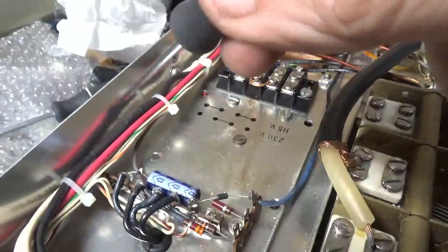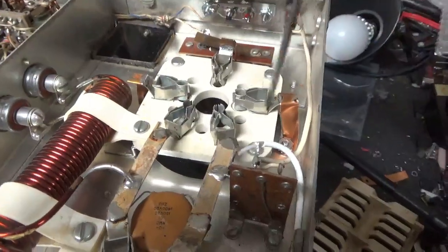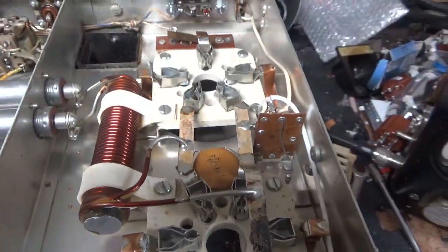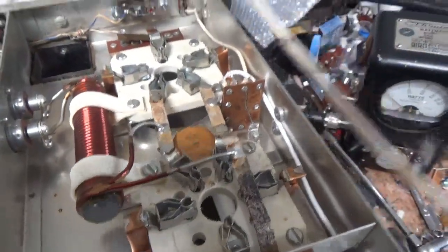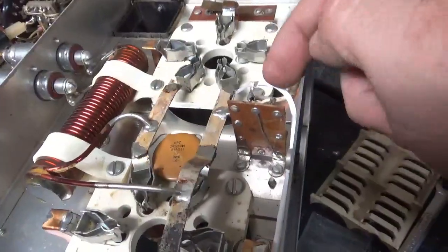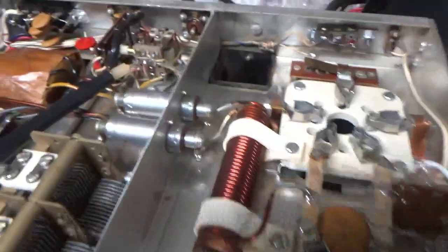I put the proper electrolytic cap in, got rid of that board, fixed the wire solder, and heat-shrunk it. I grounded the grids right to the metal — I drilled each hole out slightly larger so I can put a 6-32 screw through everything, soldered nice and clean. The one on the other side I just go through the wall with a screw and use a solder tab. The ALC wire — I don't know what happened to it, possibly flashed at some point. During certain failures you can end up with full plate voltage on that rheostat. It wasn't shorted, so I took it out and put a new piece in — Teflon-jacketed, shielded center conductor. All soldered up nice.